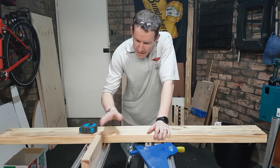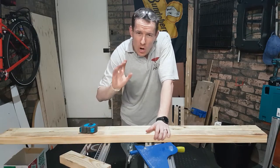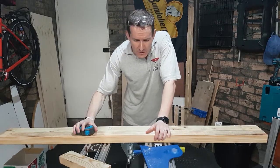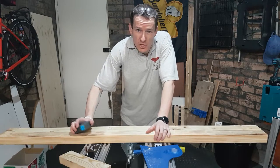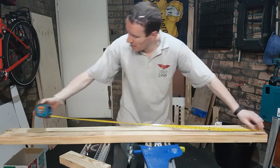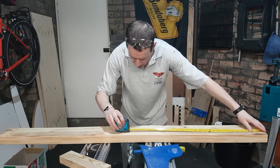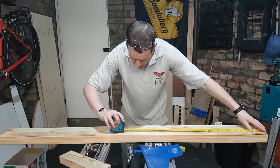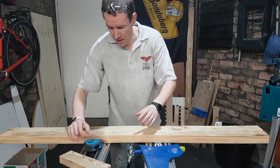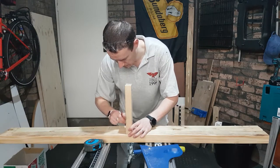I'm going to try putting the grooves in for the middle support using my circular saw. I was going to use the router but I've seen a technique using just the Kreg square cut and a circular saw - that's going to be something new for me. Half the reason I do these projects is to learn something new, not just get a job done. The boards are 153 centimeters, so half is 76.5cm - that's where I want the center to be. I'm doing both boards at the same time and just eyeballing the groove position to mark it out.